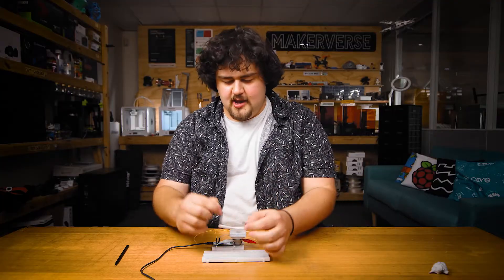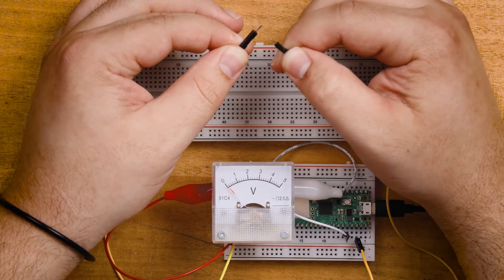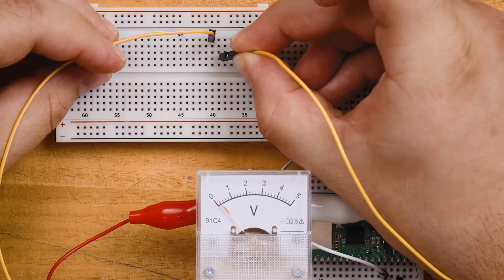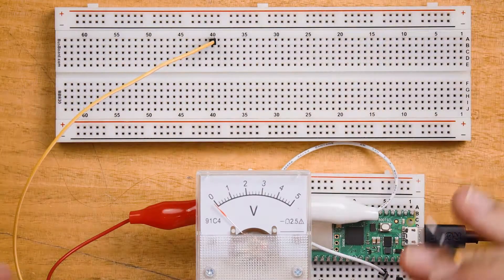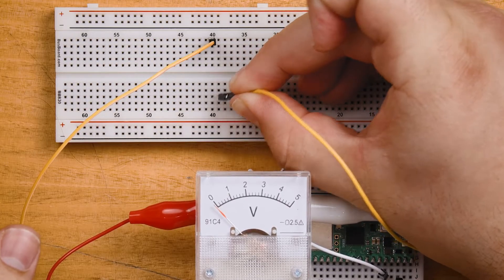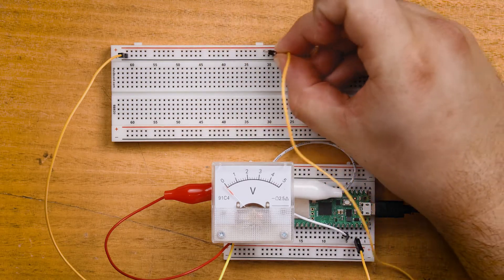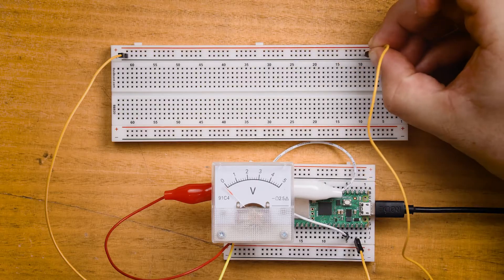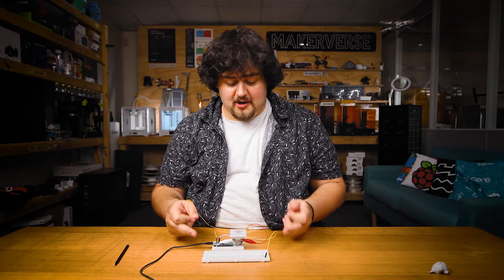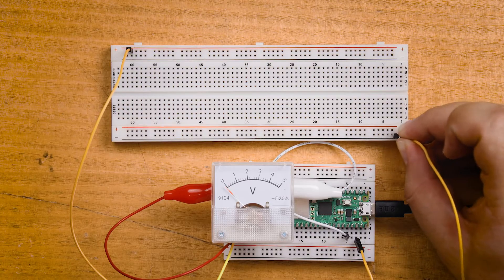Here I have a voltmeter wired up so that if I make an electrical connection with these two jumper wires, we read 3.3 volts. So if I plug one into this row here, you can see that four of the other points in this row are also electrically connected together, but not the ones next to it or the ones across the board on the other side. If I plug one into these outer rows, we can see that every single pin in this negative rail is connected together, and same for the positive one. Something that catches a lot of beginners off guard is these two outer rows are not connected together, so if I've got one plugged into here, none of these rows will make an electrical connection.